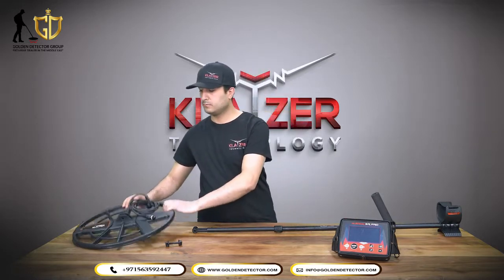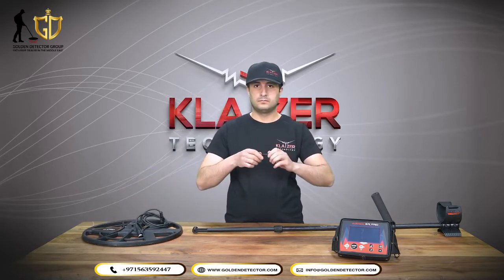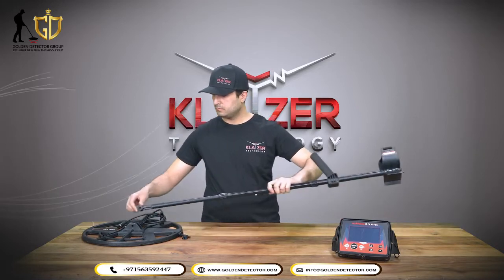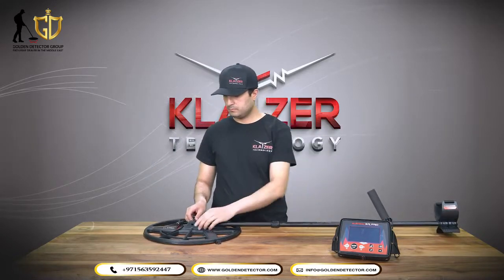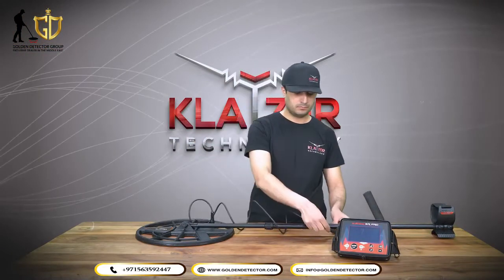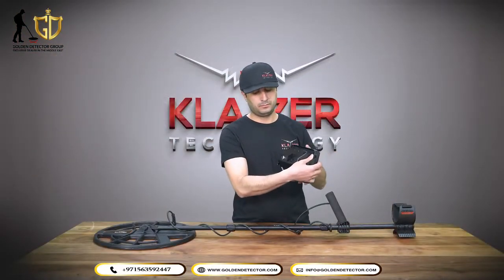Attach the lower-armed search coil G42, designated for this system. Secure with the plastic screw, making sure the arm outlets are toward the back. Connect the lower arm to the middle and the middle arm to the upper arm or stand. Ensure that the plate, device, and armrest are properly attached. Wrap the search coil cable around the arm and then attach the drive cable to the main unit and tighten the connector.